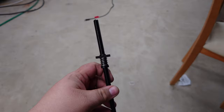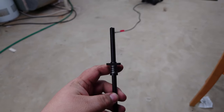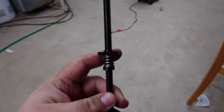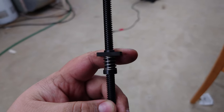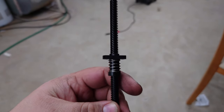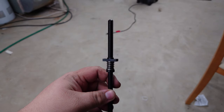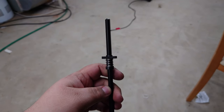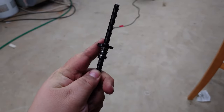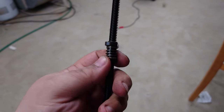When looking for replacement parts, a few things caught my eye. This is a Teflon-coated lead screw, which means it's already going to be slick by its very nature. The lead screw nut is made out of a material called POM — P-O-M — a type of plastic considered to be self-lubricating. So we have two surfaces that are already very slick, meaning it should not require any wet lube like Super Lube.